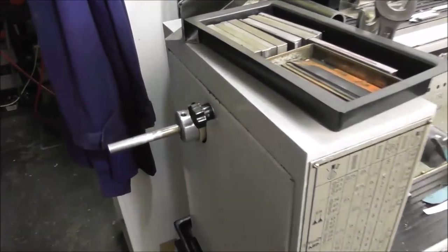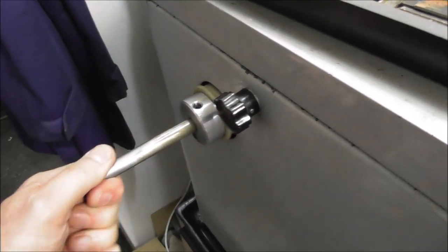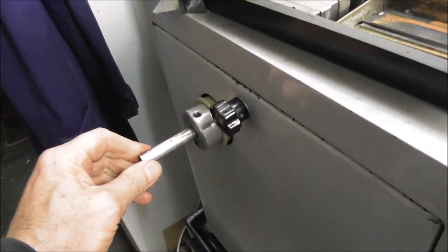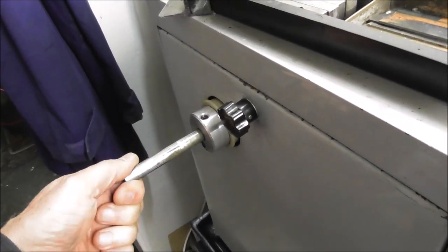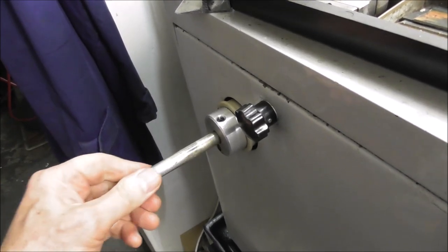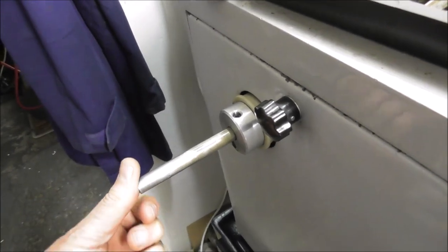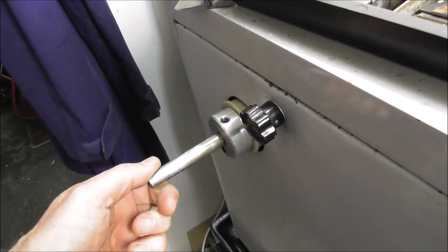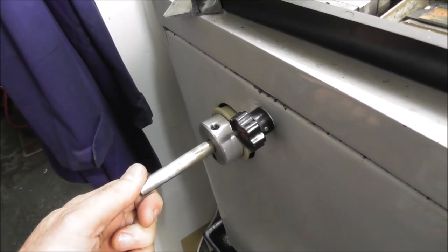Of course, an adjustable spindle stop is a very useful accessory to have, and that provides very good lengthways stopping of your part or work, especially useful for smaller diameter work that goes deep inside the chuck. But if you've got larger diameter work that doesn't go deep inside the chuck jaws, it doesn't provide the stability, security, and part alignment of a spider.